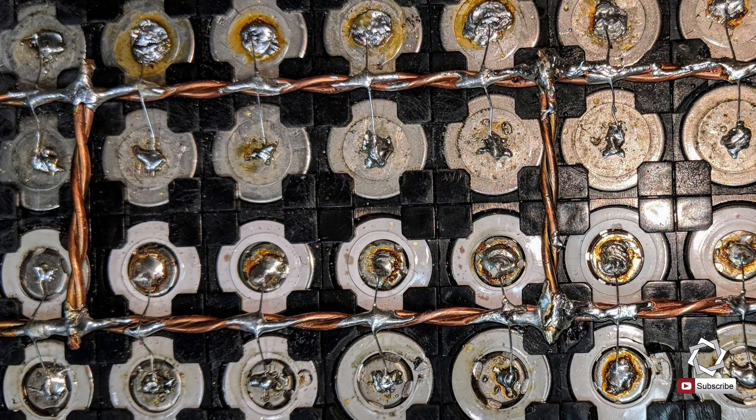There's what the bus bar looks like after the fuse has been soldered to the bus bar and to each of the cells. Then later on I'll put cross members between the cell packs — the lower section is positive and the cells above are negative, and we'll just tie them together. I hope that was helpful in seeing how I kind of did the soldering process.